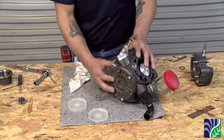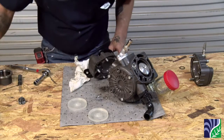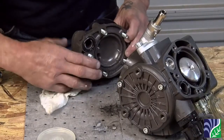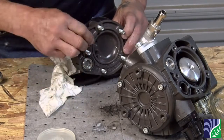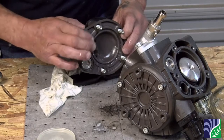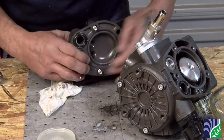Repeat this on all three diaphragms. Put the O-rings and valves back onto the pump head and tighten the bolts to reattach the pump head back to the body. Make sure the O-rings are lined up appropriately and check that the valves are in the right direction to prevent any issues.